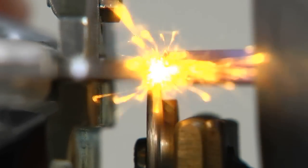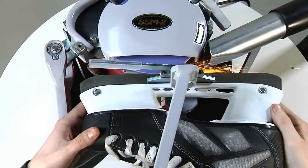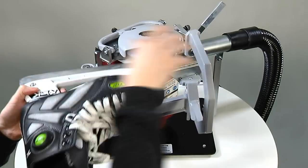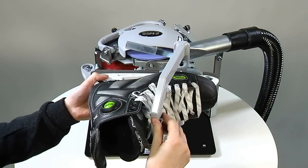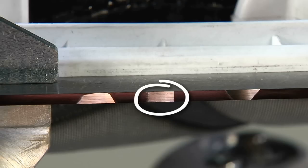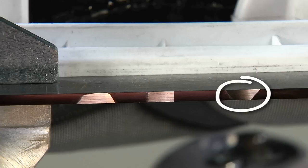Move the skate backwards and forwards a few times against the wheel. Remove the skate and turn it around. Push gently against the grinding wheel so that you can see a small grind mark. If this mark is inside the hollow, the support roller is set correctly. If it covers the lower part of the blade, the blade support roller should be lowered. Similarly, the support roller should be raised if the mark covers the top part of the blade.